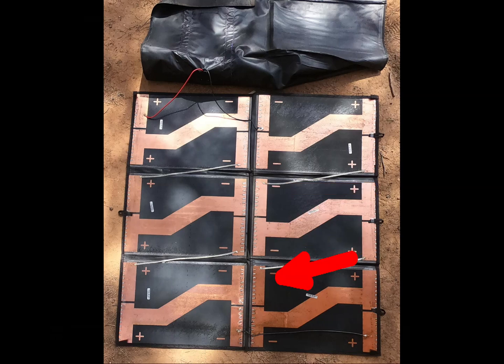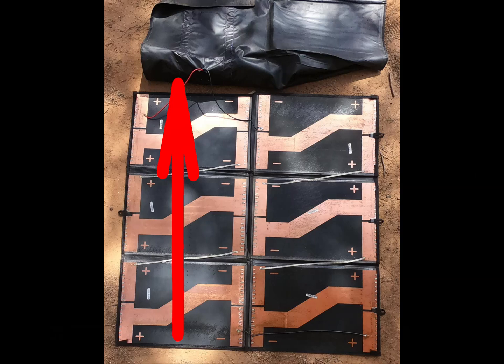At the end of the third panel there's an insulated wire joining the power from one side of the blanket to the other side, and then the whole process repeats itself all the way up to the positive wire. So in essence, in this solar blanket you've got 12 separate solar cells which are all wired up in series to provide the required electrical output.